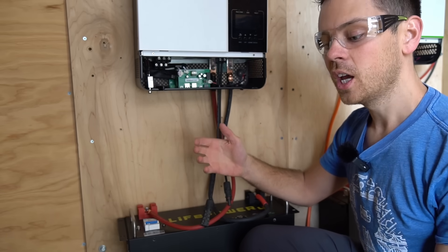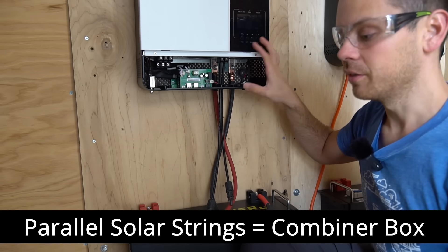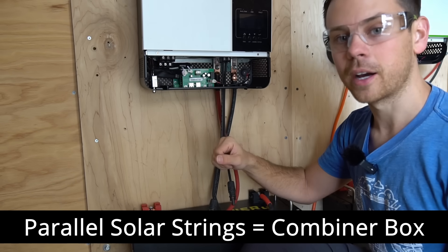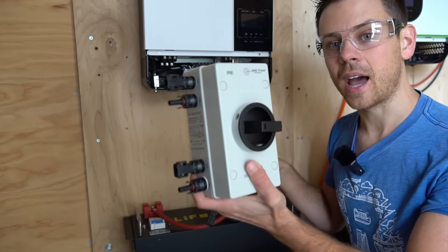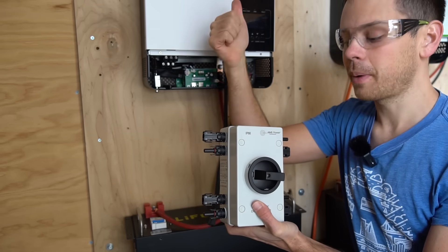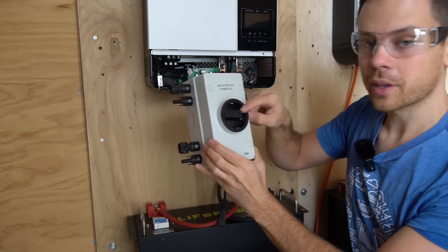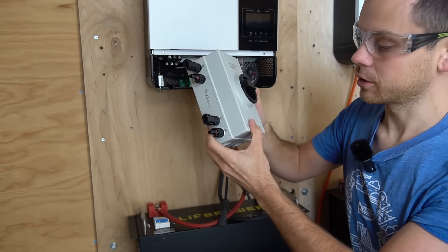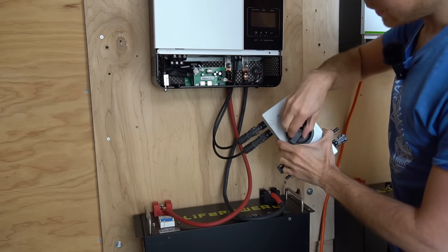If you're building a large system you're going to have to use a combiner box, especially with these Growatts, because they have a max input voltage of about 140 volts DC. That means you'll probably have two or three parallel strings and need a combiner box to put those together. For safety you can also add a disconnect box to your solar power system — it's a switch between your solar panels and your system with an input, output, and switch. Before working with it, ensure it's in the off position, then plug in your solar panels and input conductors.